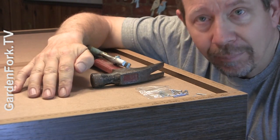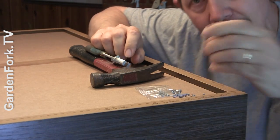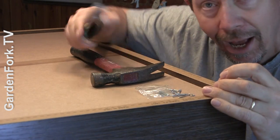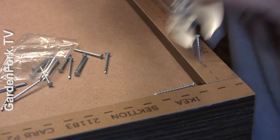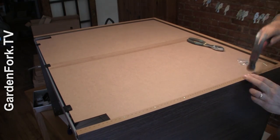Next, you're going to secure the back panel to the sides, and you want to make sure this is all tight and nice. Take these little nails and drive them in along the dotted line of the backs and sides. I like to use pliers to hold the nail — it makes it much easier. If you're working on a dirty surface or on the floor, cut up and flatten the boxes the cabinet came in to make a clean work surface, because you don't want to ding up the sides or fronts of your cabinet.